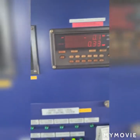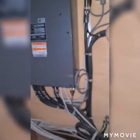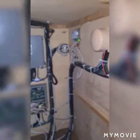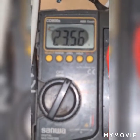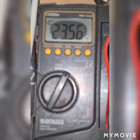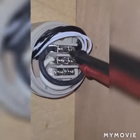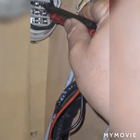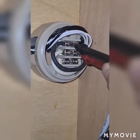The problem — why we have this alarm — is because inside I have a loose connection on the power cables. I tightened the connection there. I measured the voltage here: 23.56 volts. The caution and gyro alarm existed because this 23.56 volt connection was loosened. After tightening the connection and checking all the terminals on this box, the gyro caution and gyro error alarms disappeared.